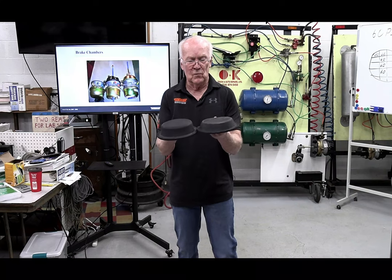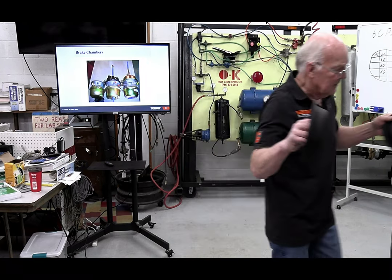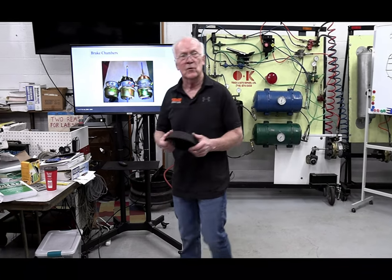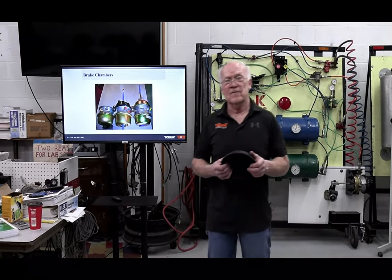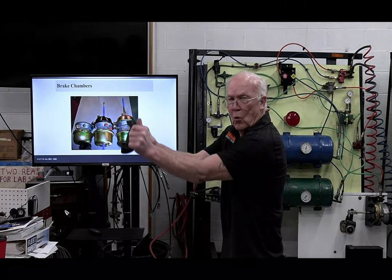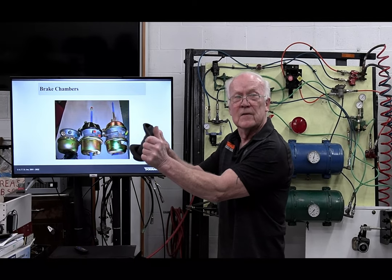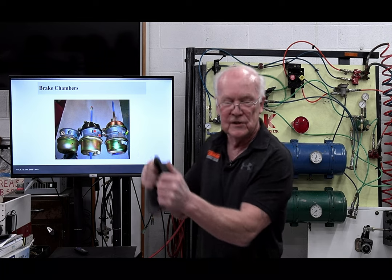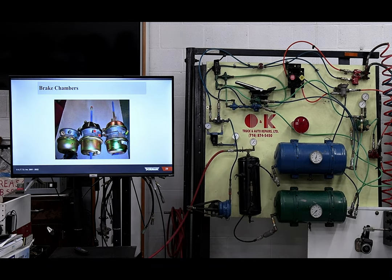But what happens is one is deeper than the other. With that long stroke, for example, type 30, the readjustment limit is 2 inches, long stroke 2.5 inches. You can picture this being deeper and you can roll out a little better, like this, farther, and maintain forces for that 2.5 inches versus 2 inches. So always be careful of that.